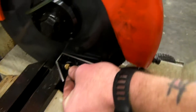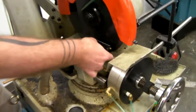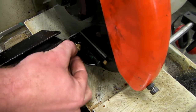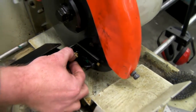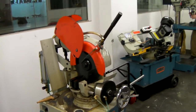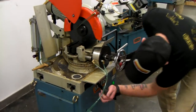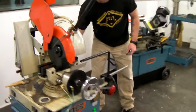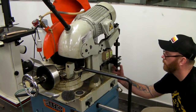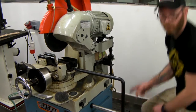You can see that we're not quite 90 degrees. It helps to have a friend help you with this — just get it into place and kick it into place just like that. That's how you adjust for 90. You can do a similar trick for 45 by just reorienting this particular piece to get to your 45. But don't forget to lock the saw. Then when you're done, come back over and tighten the screw on the backside until you trigger that limit switch, then do an additional 180 degrees.